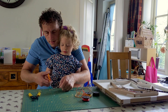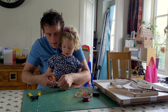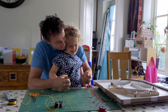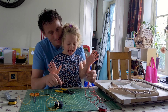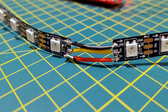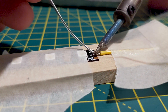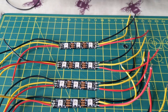After playing with the strips and confirming that the same CircuitPython code would work as well with 180 LEDs as it had with the NeoPixel rings, I began to snip and group the LEDs into sections. Cutting through the copper terminals and stripping wires was straightforward, but soldering proved torturous at first. You may want to look away now if you're good at soldering or holding a pen or playing Operation. Eventually, though, I found my groove with a series of not-terrible joins.